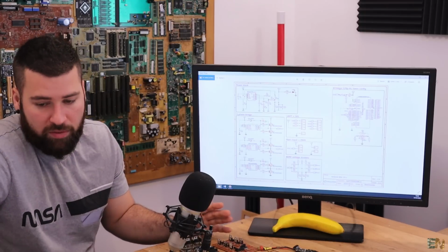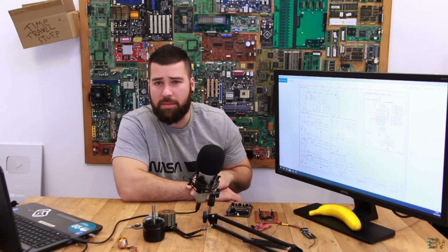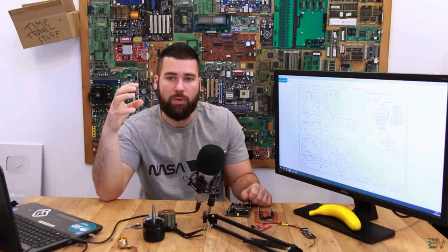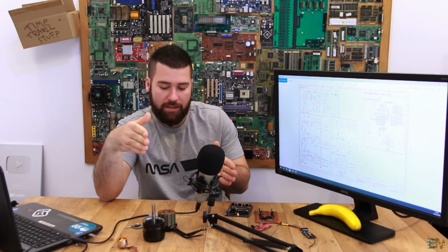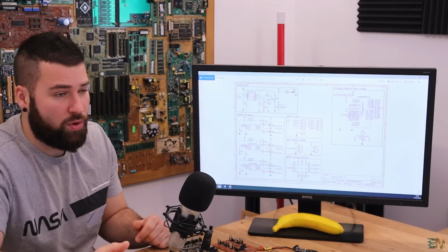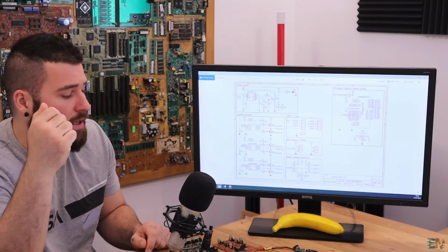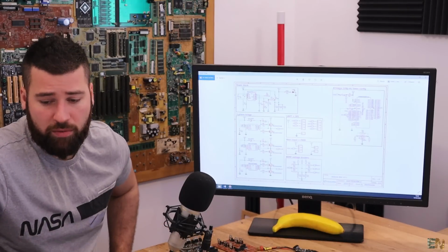Another improvement that I want to make is a better version of the firmware, because I have some small steps in the code that are having some troubles. For example, when we first start the motor, we have a loop that will create the first rotation of the motor. That loop is always predefined, it is not controlled with the PWM for the speed, so we'll have to make some changes there, maybe use more of the EEPROM memory of the chip to save more values, for example for the configuration, to save the maximum speed and the lower speed, to maybe even have some modes in the firmware. So that will also be an improvement that I want to make.